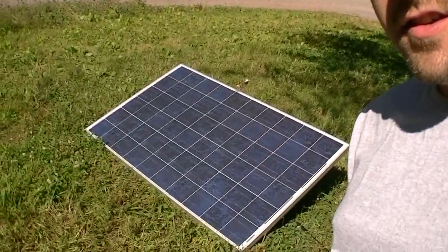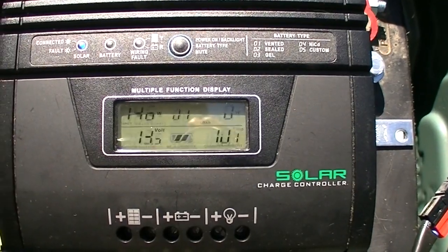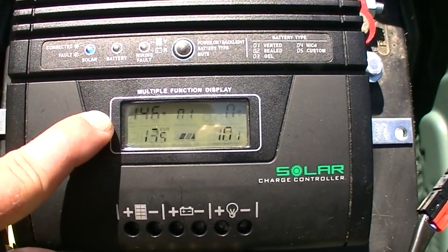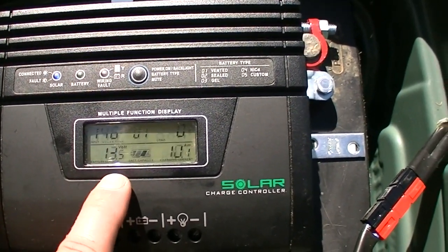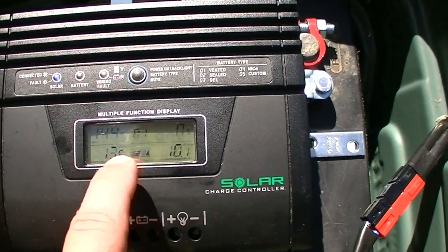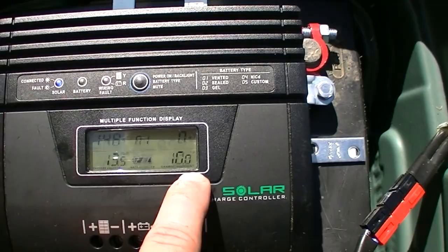I'll be back in about an hour or two to show how it charges at about 12 amps and kicks the battery up really quick. About an hour and a half later, the solar panel is now fully in the sun. Let's check the charge controller. Since the sun isn't all the way at solar noon yet — it's still only about 9:30 — I have a 200 watt panel and we're getting 146 watts. We're getting 10 amps of charging current into the battery and the battery is already up to 13.5 volts. This charge controller needs to bring it up to 14.4 to fully charge the battery, then it'll bring it down to 13.3 to float it. Nothing's running right now, so all 10 amps are going directly into the battery.